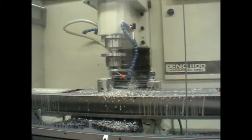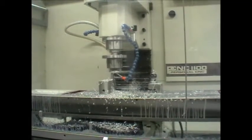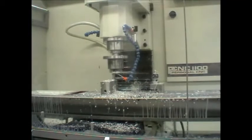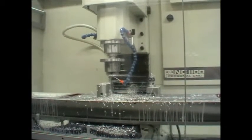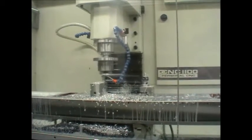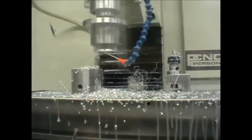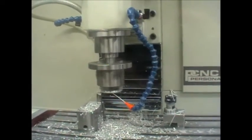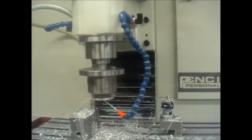Run it at greatly reduced speed — it's fairly safe and you can get there. Admittedly it took me a few goes to get it right, but I got there in the end. That is the area where I'm most weak. Really this video is about some of the more mechanical tips. I've learned a lot from YouTube videos, so it's nice to put something back. My main contribution here is about chip breaking — you need to have the swarf coming off in a broken form like a cutter so it can run automatically. I'll show you later about mounting the little three jaw on the R8 shank and how to set it perfectly true.